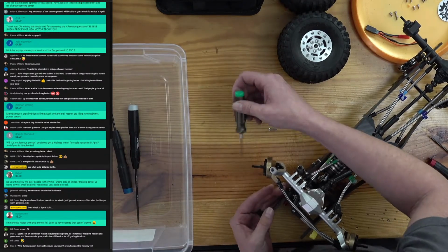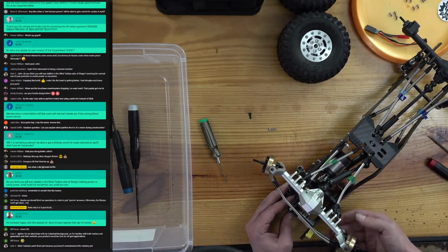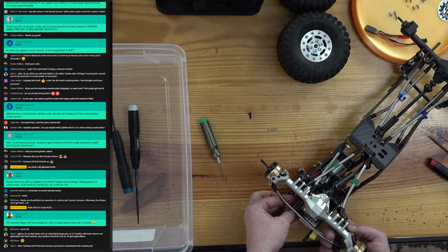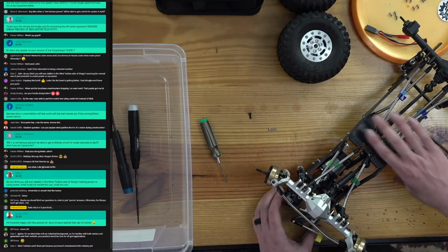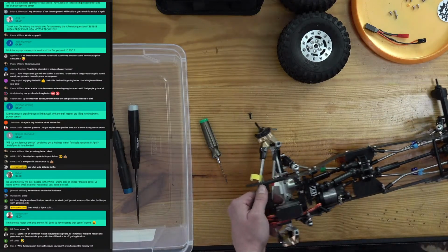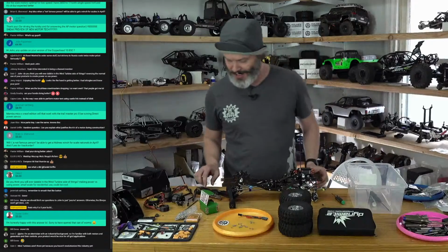So the startup. A really good indication on a design is when you start noticing the minimum startup RPM isn't tracking linearly with the KV. You know that you're getting out of the range of what the stator is designed for, and the magnets are a pair in this fantasy world that I'm talking about again.